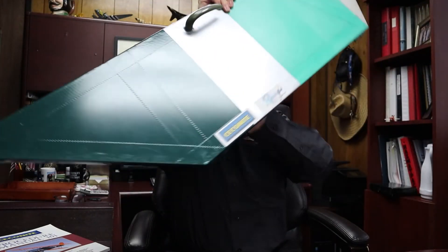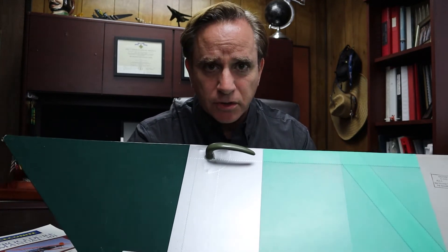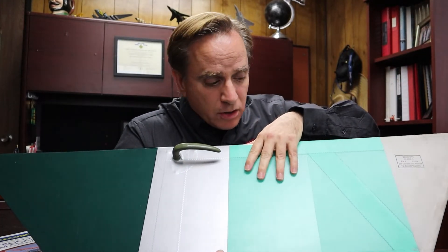Color dope has the lovely ability to be polished into a really deep luster. That's why a lot of the old timers — the people that really know and love dope — use the stuff and continue to, even though it's quirky in weather to a degree. It polishes up really nicely. For those of you who are the diehards, be aware: this is part of the technical aspect of the dope system. It's a generation older than the polyfiber system. And this part where you transition from nitrate to butyrate — if you're working in a cold environment or you move too quickly, you can cause problems for yourself.